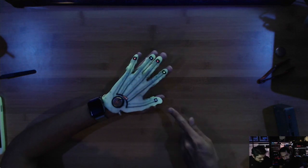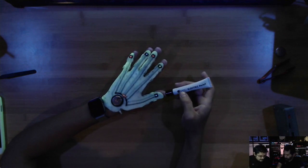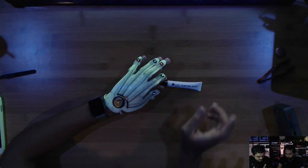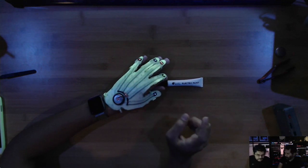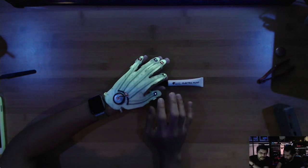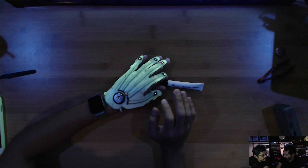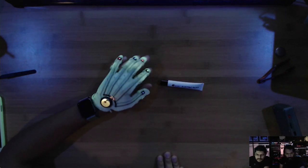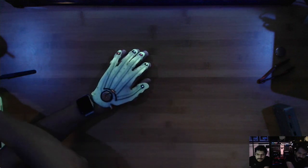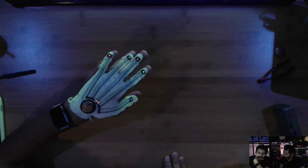But you use bare conductive paint to stick those LEDs to the pads. Yeah, so this works excellent with bare conductive paint. It doesn't peel off, it stays on nicely. It bonds very well to the NinjaFlex and the conductive filament, so if you didn't make any snap together or snap fit parts like we did for the battery, you can just, on the surface, sort of mount or bond these together. That is so cool. So very awesome that we're able to use multiple conductive filaments to create this flexible wearable.